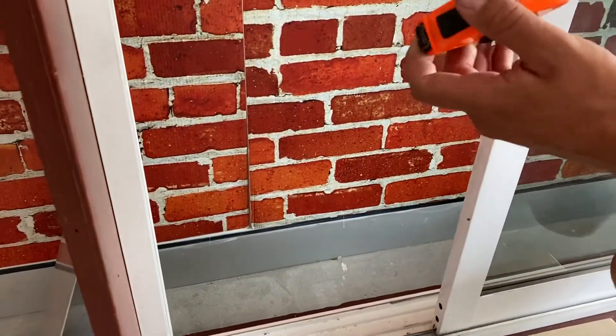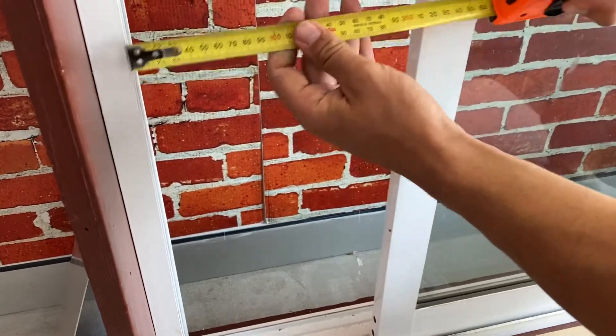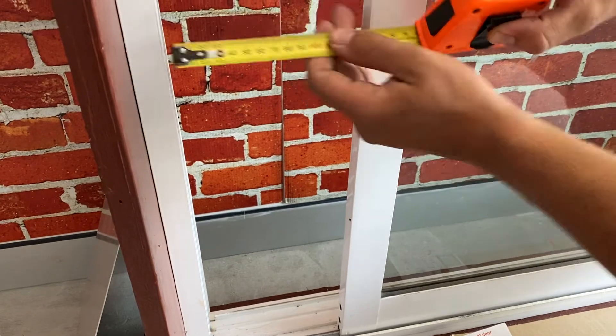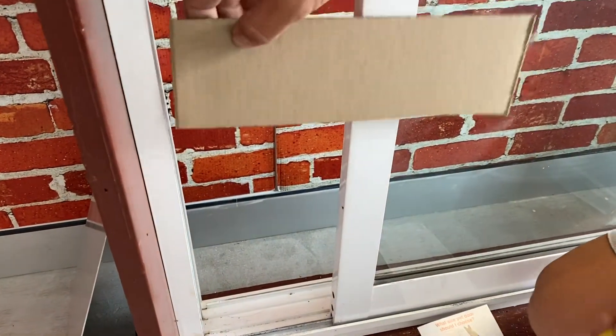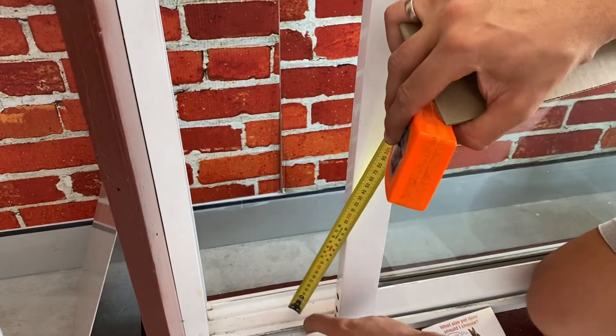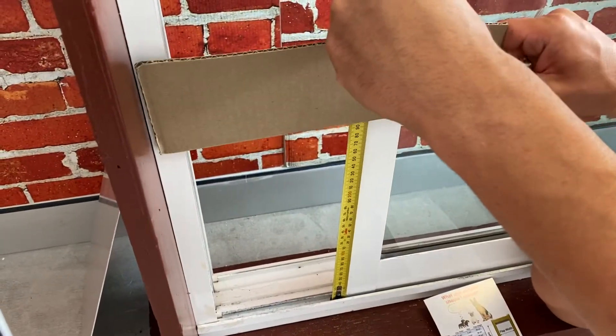Open your sliding door to 16 centimeters — so go from that point to a 16 centimeter opening. Use a piece of cardboard and put the tape measure to the bottom of your track, go in at the bottom and measure 29 centimeters for the small size.